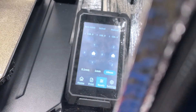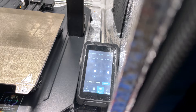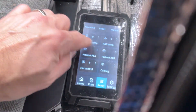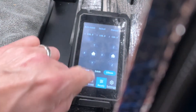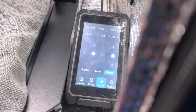This is just however high you need to be able to see what you're doing — I've changed this a couple of times. Now we want to place a rag or something over the bed so that no hot parts fall on and damage it. Then we're going to set the extruder temperature to 260°C. You always want to crank the temperature up before you remove the nozzle because these parts expand with heat and you want to make sure everything fits nicely.